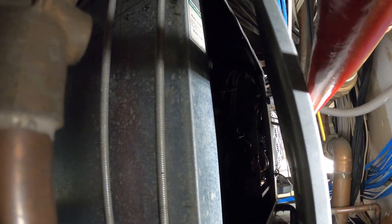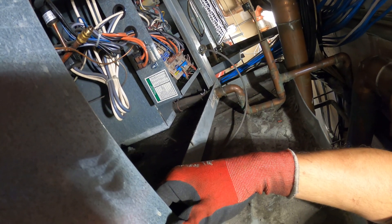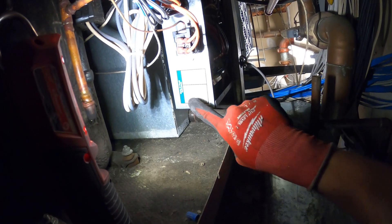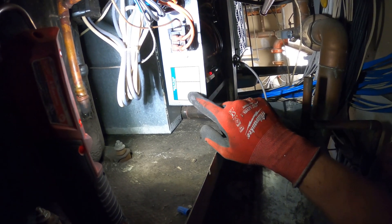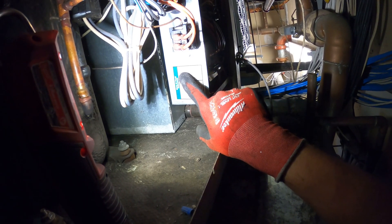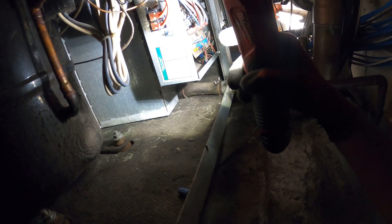Here's our AC unit. I see a red blinking light to start with. Right here it says fault indicator — we have a blinking red light. Red flash means high pressure fault. It's always good to look for any type of cover or information you can find on the unit; typically they have it inside the control panel, but this is right on the side. So: high pressure.